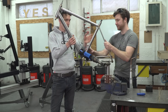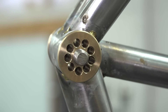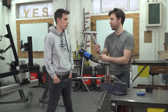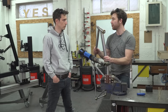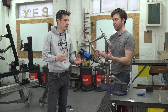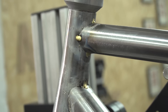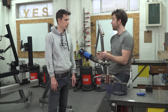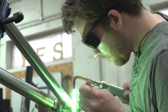What are all these bits and bobs plugged into the frame? In the head tube we've got big lumps of brass — these are heat sinks. They draw some of the heat out of the tubes when we're brazing, basically protecting the tubes from overheating and helping maintain their shape. The tacking we've already done is little spots of braze, so fundamentally it's the same thing, but there's not enough there to do the job. You could probably build this up and try to ride it, but it will fall apart. So we're going to put more braze on and then it will be nice and strong.